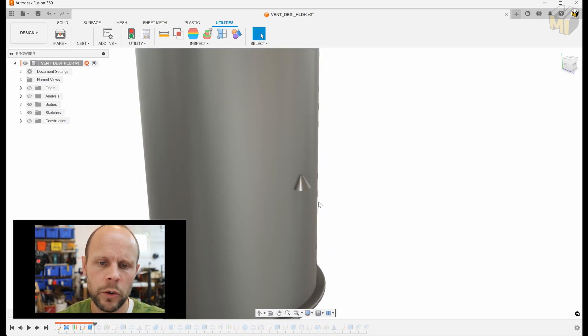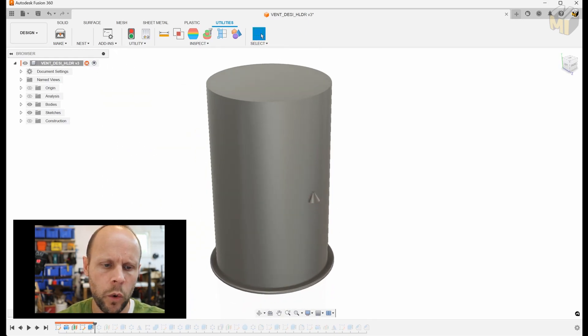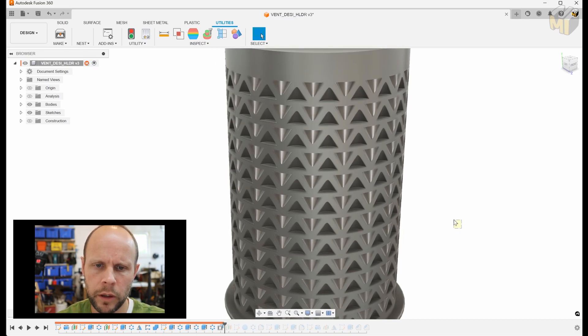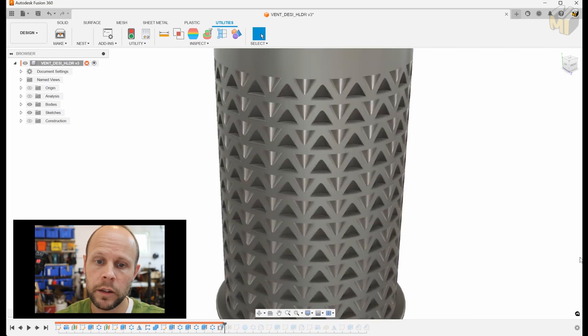We can start with a small shape like this, have it go all the way around the cylinder, and cut into the cylinder. This is just the shape I went with — there are probably lots of other options. It has to have a continuous path when it extrudes the material, so this particular shape allows that in-and-out motion, leaving voids in there, which is exactly what we want.